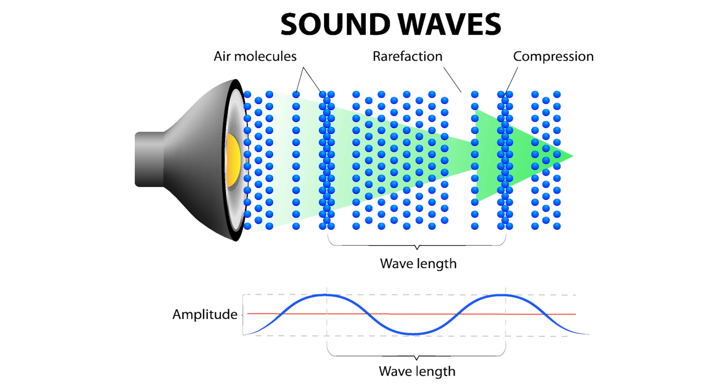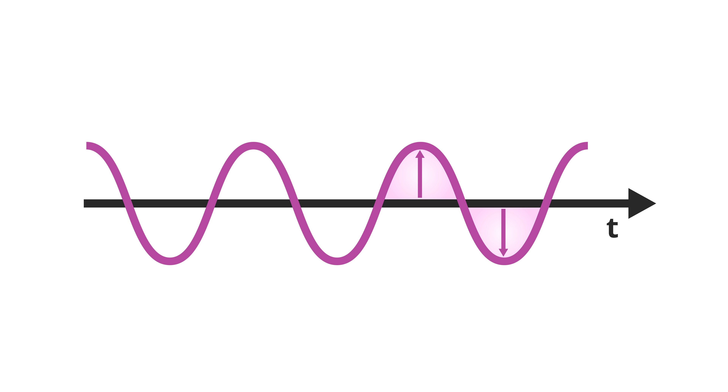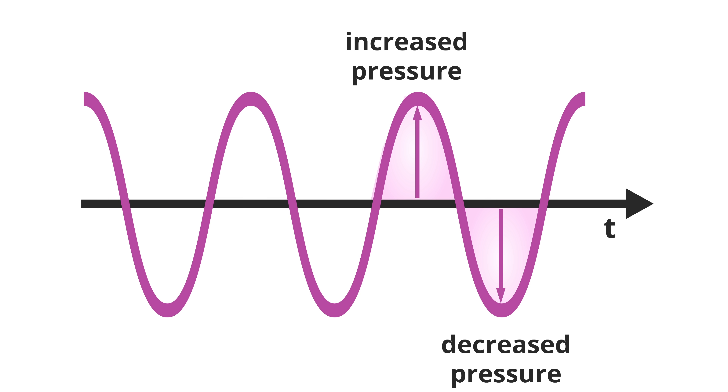So this bottom metal is vibrating at 42,000 times a second, sending sound waves through the water. A sound wave means that molecules are pushed closer together and further apart at a regular frequency, creating pressure waves that propagate between high and low pressure. This deviation in pressure is called acoustic pressure. For a given amplitude, the higher the frequency, the higher the acoustic pressure — so you can either turn up the amplitude or increase the frequency to create extreme pressures. Ultrasonic cleaners use extremely high frequencies to create extremely high acoustic pressures.